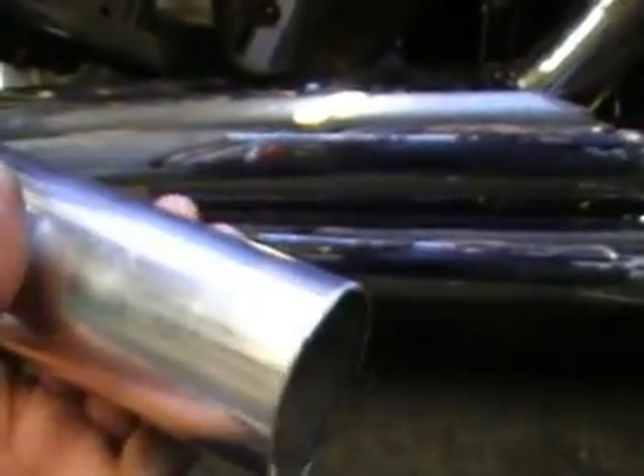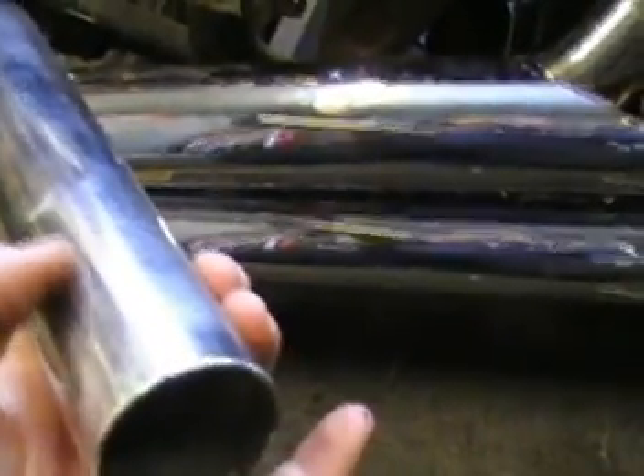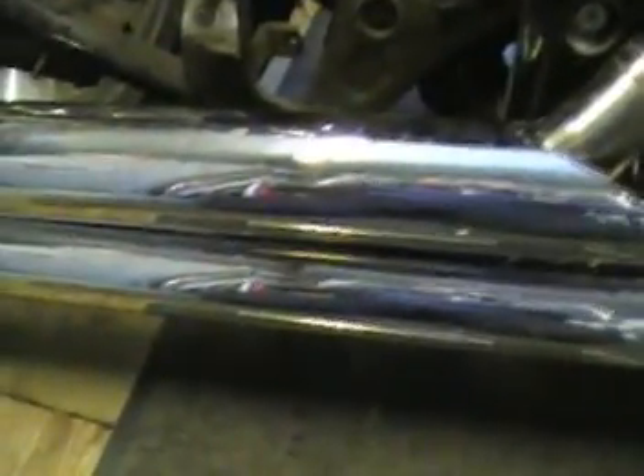That definitely needs to come up a bit to make the two pipes parallel with each other. It's not a bad gap here — chrome flaking off that — but obviously that won't do where it's touching there. Inside here I've got one tube and this is the outside skin, so the inside part fits inside there. There is a gap, and basically this piece of stainless exhaust — an offcut I used on the BMW — if I cut it down to act like a spring, it will button the inside tube to this tube and it will fit quite nicely. Plus with a couple of jubilee clips, you'd have to do the same on this one here, and then that should work fine.